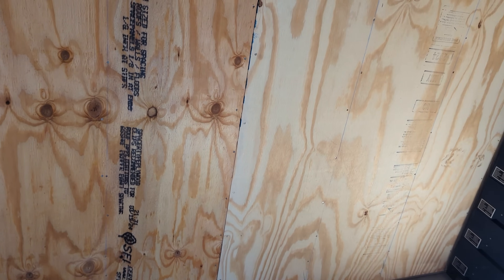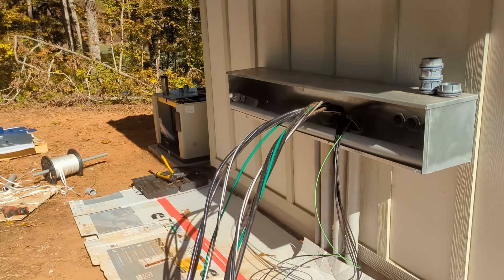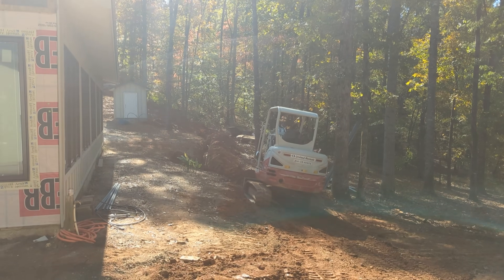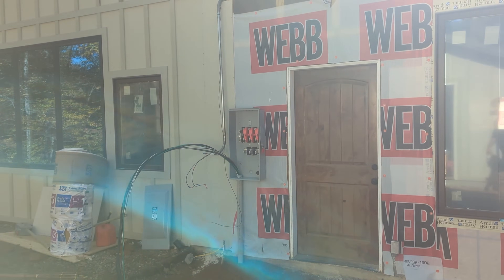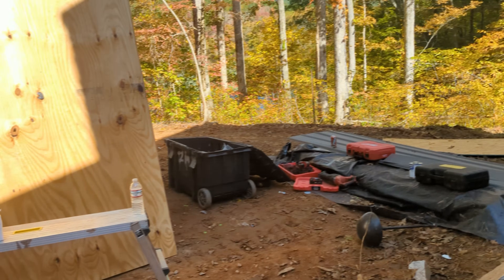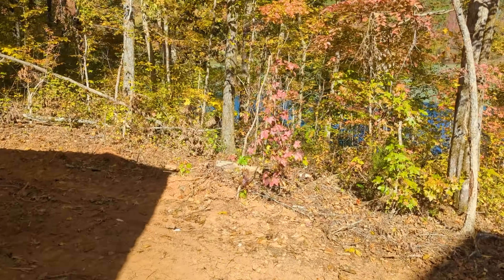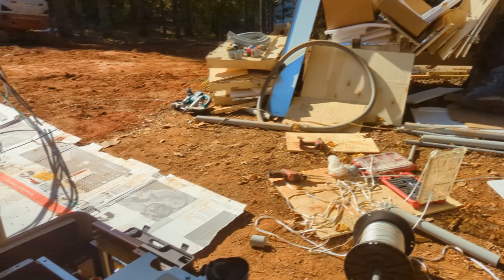It's day three and a half — we're pushing to get this done this week. We just pulled in the solar wire: 400-some feet. There'll be a bypass out here and a 200-amp pass-through outdoor panel. Feeding direct bury, we're going 500 feet to a new shop up on the hill where the solar goes, and then we have a feeder over to the house. A fusible disconnect and then SER cable runs inside to the house panel. The bypass handles the generator — we'll be able to run the whole place on the 20kW generator if need be, and otherwise it'll be there as support for battery charging with a two-wire automatic start.